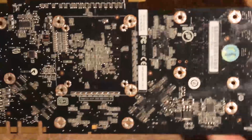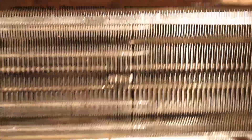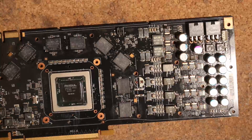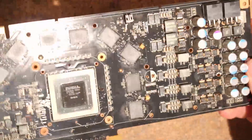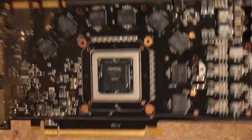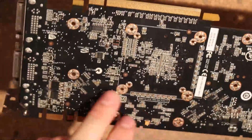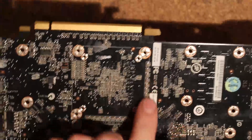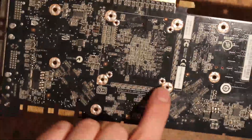For something like chilled water or single stage, this should be fine. I will soon find out because I'm going to put this one on a single stage — it has the exact same VRM and it is 55 nanometers so it should draw a bit less power. All in all I expect this to be a pretty easy card to work with. You can also have some really nice spots to add caps later.